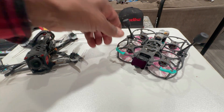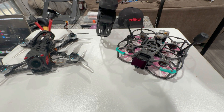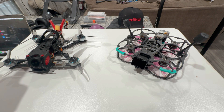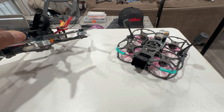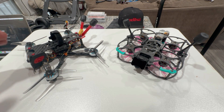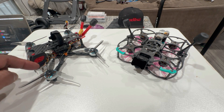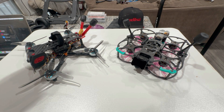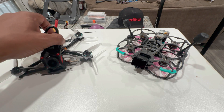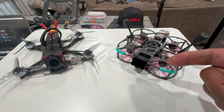The purpose of this 3.5 inch build was to complement the Huma — where if the Huma could not handle the winds, I needed something a little stronger. The Huma has two-inch props and this build has 3.5-inch props. I've seen a couple of high-end drones out there with the DJI O4 air unit, 3.5-inch props, and 1604 T-motors costing a pretty penny. You also need to carry a mini GPS on board as well as a lost buzzer — you need both the GPS and lost buzzer to do the setup if you want to travel abroad and get long-range video.